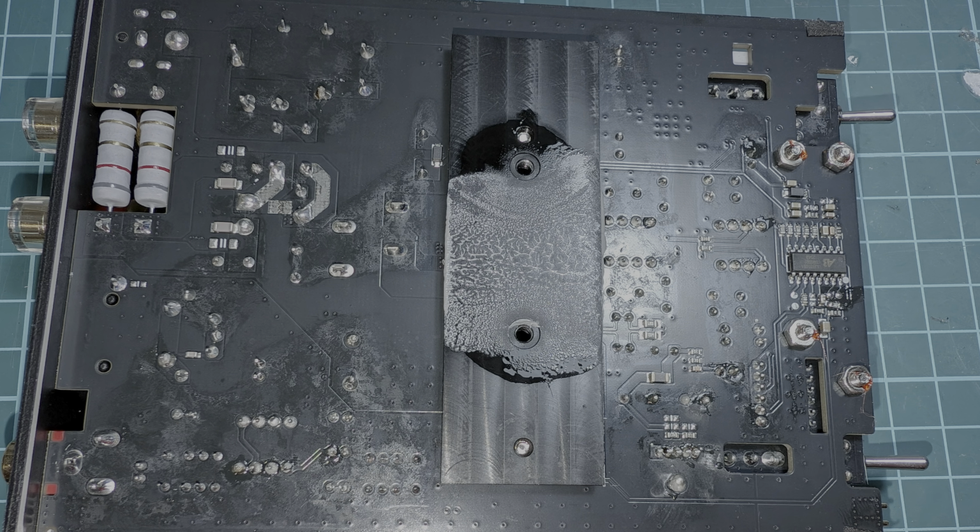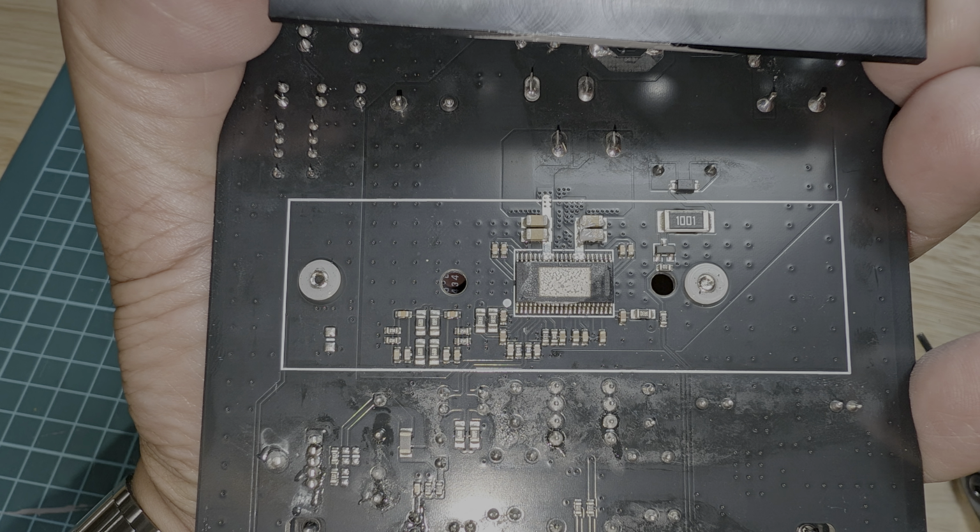So I had 2 of these set up and both were working fine. I just kind of left them on, and I figured the auto standby would keep it cool. Not a hot day, just a normal day. And the next day I came and one of them just wasn't working. When I talked to my friend, he talked about quiescent wattage, and how much power was actually being put out even at idle. And he said that even with the idle wattage, if you were to put your finger on that chip, it would probably burn your finger. So it's not nothing. That's something you should be aware of: when people are having these issues, I think it is a real thing.